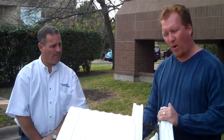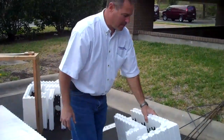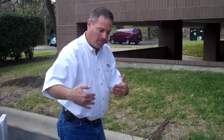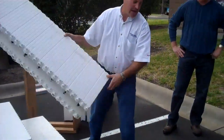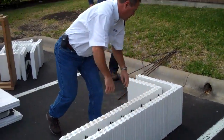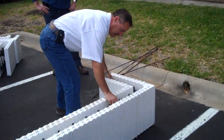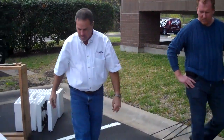What we're going to do right now is let James build something. I'm just going to start at one corner and pretend like this is the slab that's all drawn out. So we'll start at a corner and work down to that corner, meet in the middle, and that's where we'll make our join in the wall. It's windy, so I'm going to go ahead and stick some rebar in as I go so you can see how it works. On your corner, we'll have a piece of rebar that snaps in here on the loaded side, and as we go up, we'll alternate those so we can drop vertical rebar down through it.